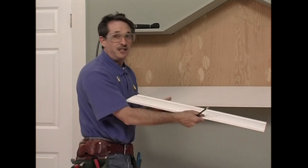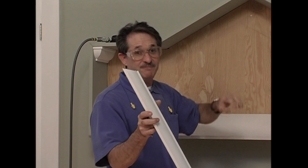Joe Fusco taught me that a few years ago. In fact, it took him a few years to teach me — I'm really kind of dense. Remember, as soon as you make a turn from horizontal to raked, you're changing the plane of the molding. Now let's go cut this piece. I think we'll cut these pieces one at a time. There's just too much room here for error, not because it's difficult, but because each corner is unusual.